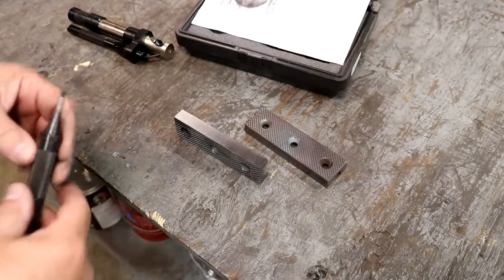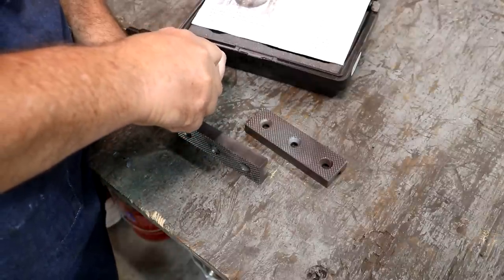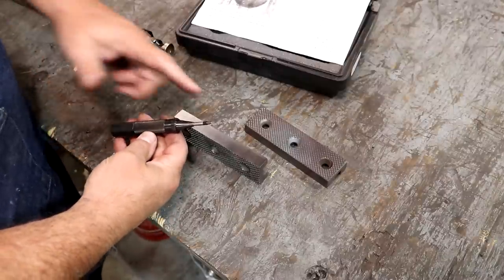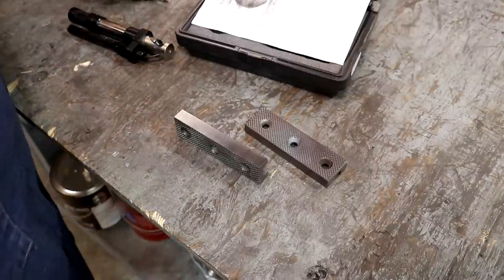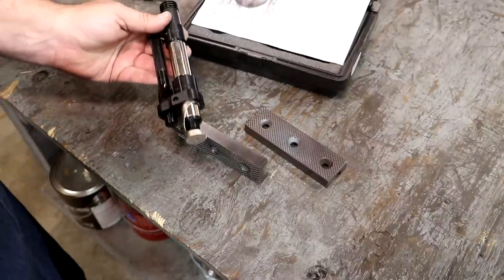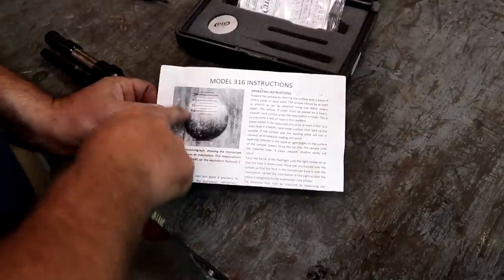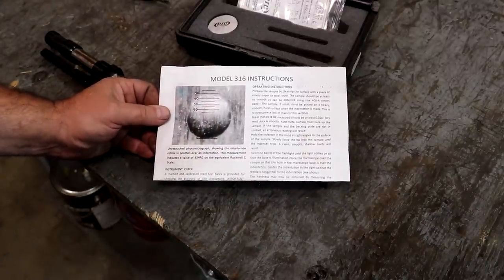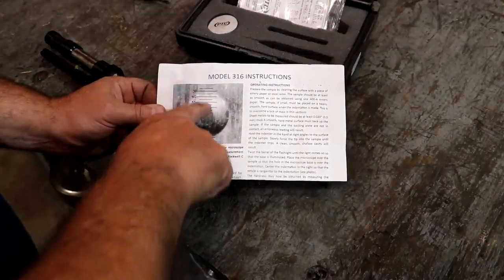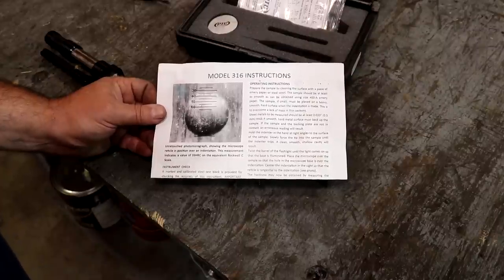All right, so I've got a little PTC hardness tester, and this one gives you a rough idea of the hardness. What you do is you start out by making a little dent in there, and this is just a little spring loaded. This is calibrated, it's got a blunt end on the end, and that makes a little indention in the metal. And then you use this little tool, it's like a little telescope, it's got a light in here, and you look down through it. There's a scale that is basically imposed over the top of that little indention you made. You can put one edge of the indention on the bottom line, and you read up here on the scale a rough estimate of the hardness.